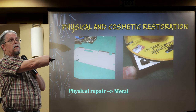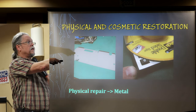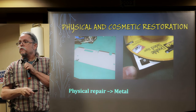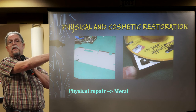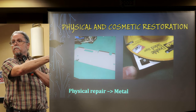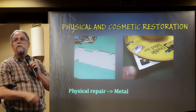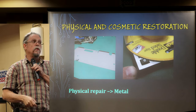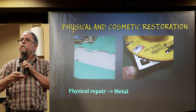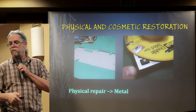For metal front covers on keyboards and calculators, gluing has always given me mixed results. I found a really thin double-sided tape by 3M — you slip a piece under the lifting corner, push it down, and trim the excess with a sharp X-Acto knife. It seems very similar to the factory adhesive used originally, and it also works great for larger rubber feet.